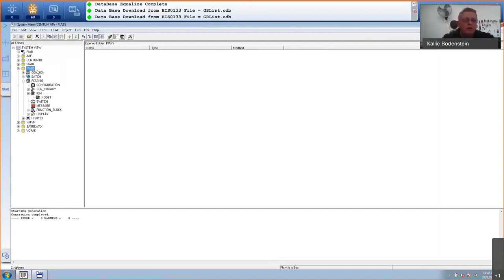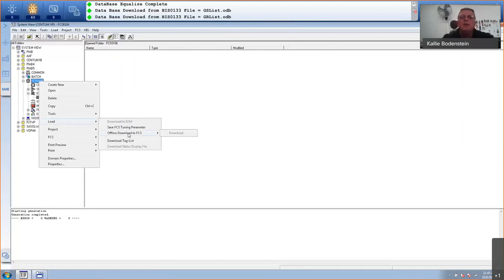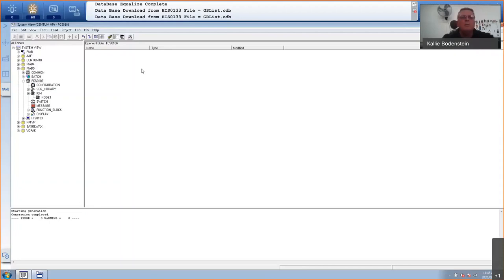Usually what you will do in this case, so if that is not your current project, but this one is, you will go to your FCS, right click on it, go to load, go to offline download. This is your very first initial download to the FCS. And then you'll click download, and it will not be grayed out like mine, because mine is a user-defined project. Your current project will be able to download. Then it'll take about 5 to 6 minutes, depending obviously on the size of your project, and then it'll download to your FCS. So this project, which is exactly the same as what I've done now, is already there.